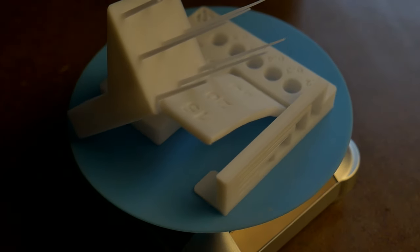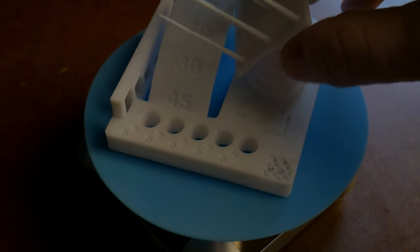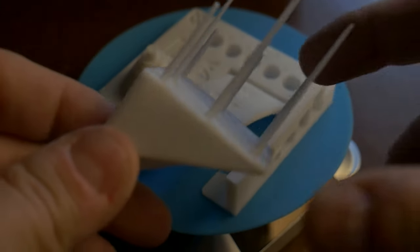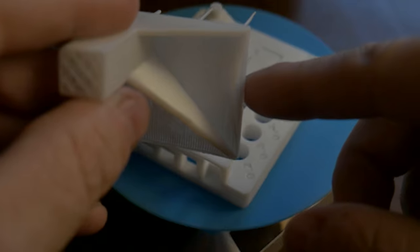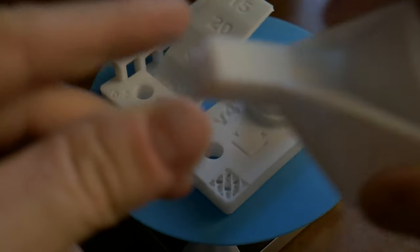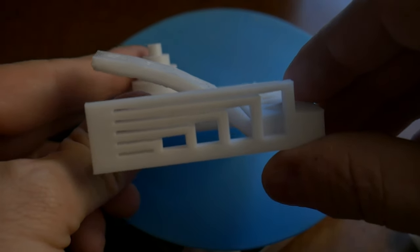I ended up dropping the open source printer evaluation by Autodesk on the floor, so it doesn't look as good as it did when I took it off the printer. All the intricate overhangs and bridges printed really well with just a tiny bit of sagging. The needle-like spires all printed great, with only a tiny amount of fuzziness or stringing on the furthest left rear corner. I suspect the bridge sagging and the spire fuzziness can both be attributed to a small deficiency in cooling, but the outcome of this test is still highly above average.